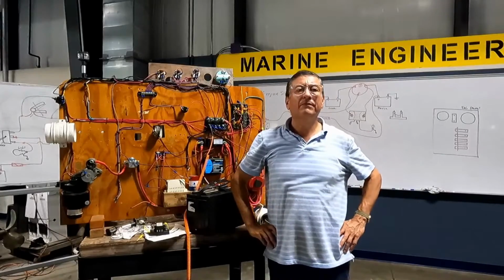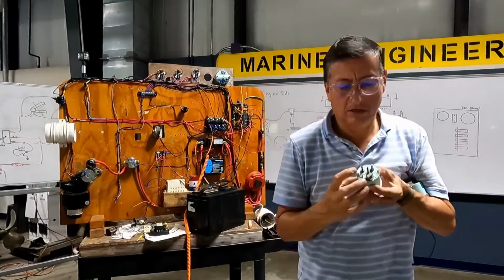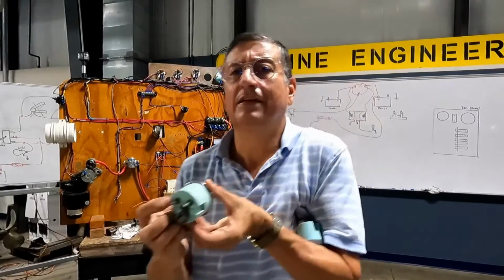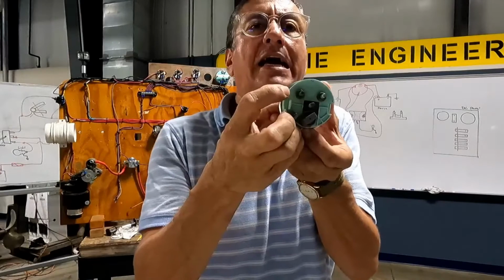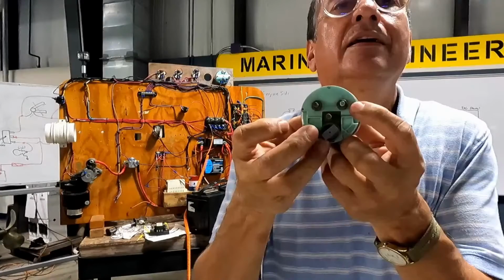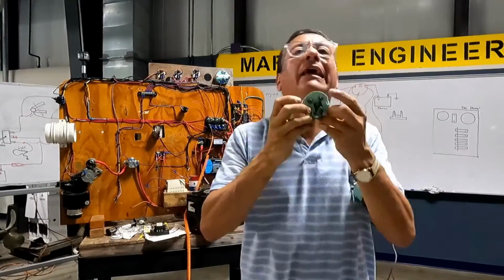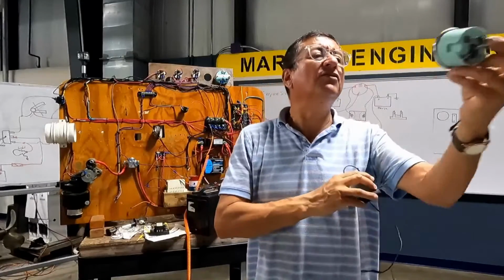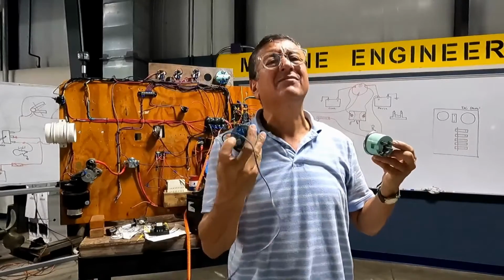Anybody follow me? Okay. What is the middle one? Ground. What is this? Signal. Oh wait, ignition. It's the I, ignition. And the other one? Start, or signal. Signal, ignition, and ground. It is always the same. This is oil pressure, this is temperature, it's exactly the same.